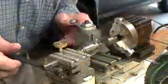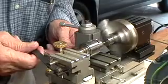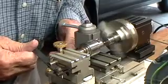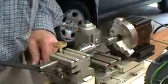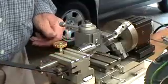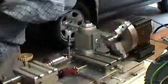We're about to use a number two center drill just to start the hole, which will be a number 13 drill, which will then be reamed out by a one-thou undersized 3/16ths reamer. That's enough to start the drill — now take the center drill out.